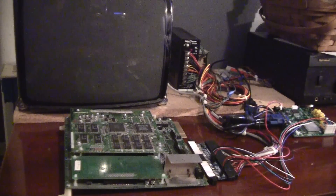The capture card is an AVerMedia Game Broadcaster HD. Google that and you'll see what I'm using. I'm running the VGA from the converter to that card, and I'm running the audio from the JAMMA harness and the game boards directly to the line input on the PC as well. That's how I capture both the video and the audio.